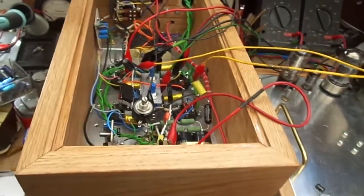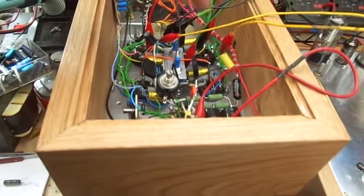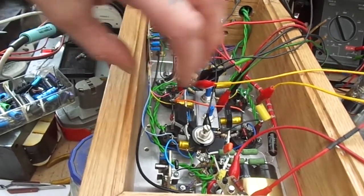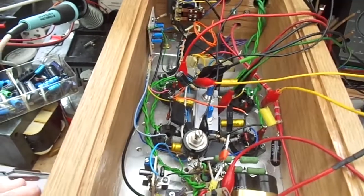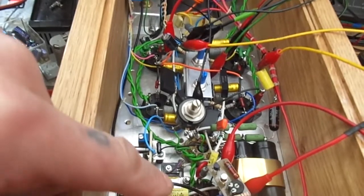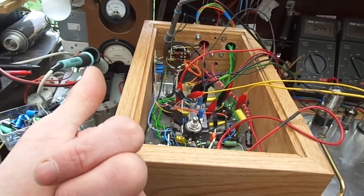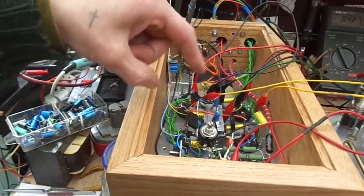So normally what you would do, I think, in this case is to put a capacitor at the end. It's a bit like putting capacitors across the power supply inputs on an op amp. Anyway, that didn't work. Reducing the gain of the front end did. So now we've sort of improved the low frequency stability, but we've sort of killed the high frequency stability.